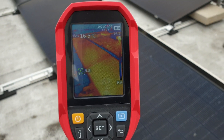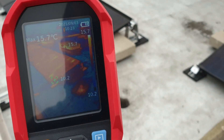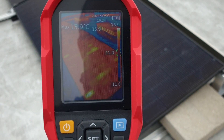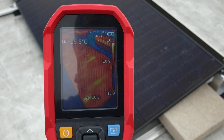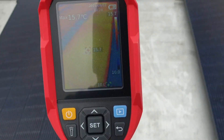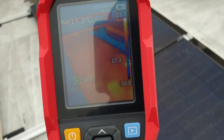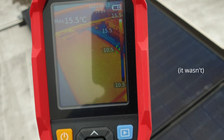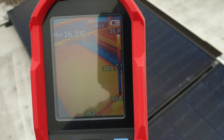You can see these panels at the front have a fairly uniform color, but if we walk over here you can see all the individual cells in the panel — that means this one is generating and that one over there isn't. Then at this end, you can see that the one at the end isn't generating, and I'm wondering if that might be our culprit. We can also verify this with the clamp meter — I'll pop some pictures in in a sec.